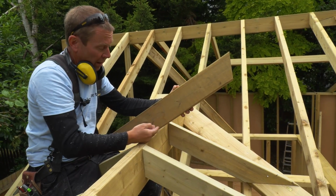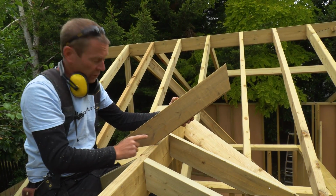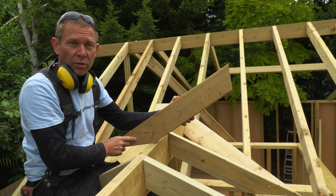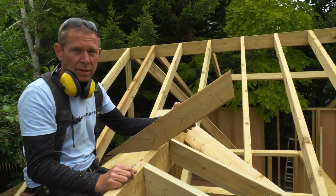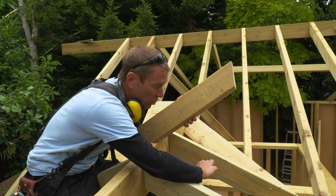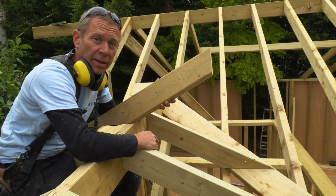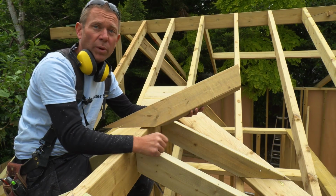Because we're doing the square, this is 65, 25 from 90, 65 degrees. So that's a 65 degree cut down at the bottom. So you'll always know, it always comes back to 90, by finding the top one. Once you've got the top one, this is square off of that, square off of that, and it's all come up to the 90 degrees. So 65, 25.